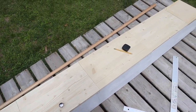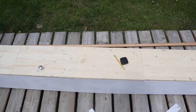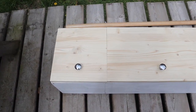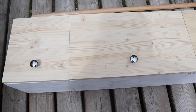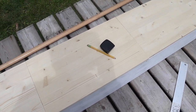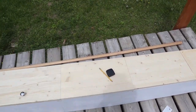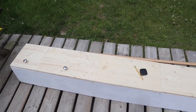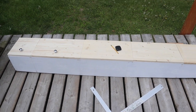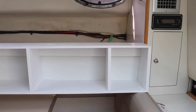I've got my doors all cut and fitted — everything fits the way I want it. Now I'm just measuring about two inches up from the bottom, finding the middle of each door, placing the knobs on there, and marking where I'm going to put them. That's the next step — get the knobs prepped, then it's sanding, priming, and painting the doors. We're moving right along.